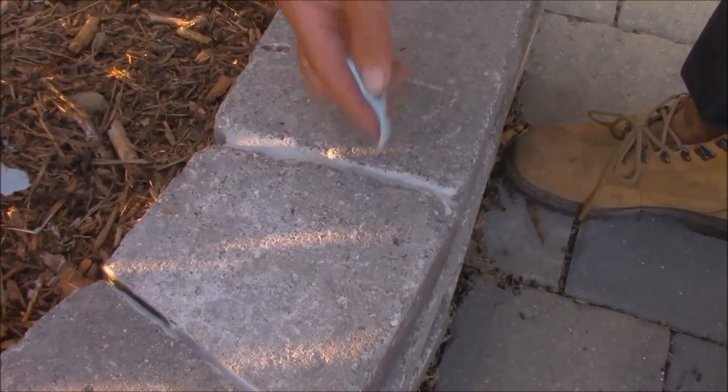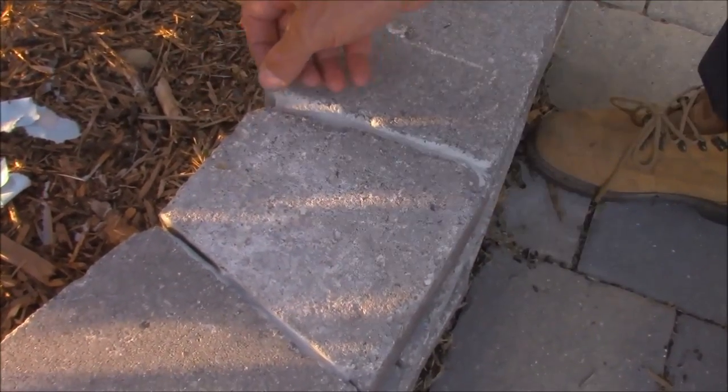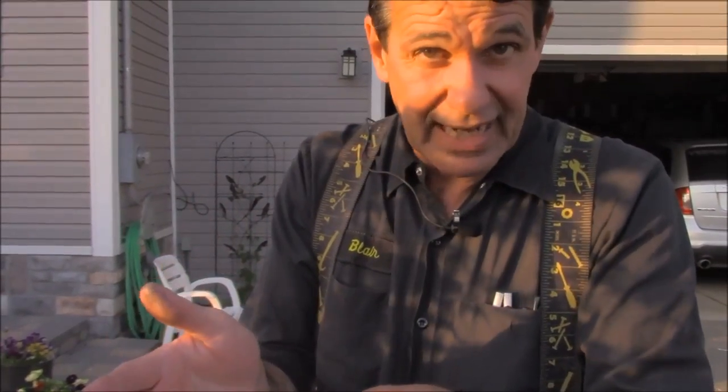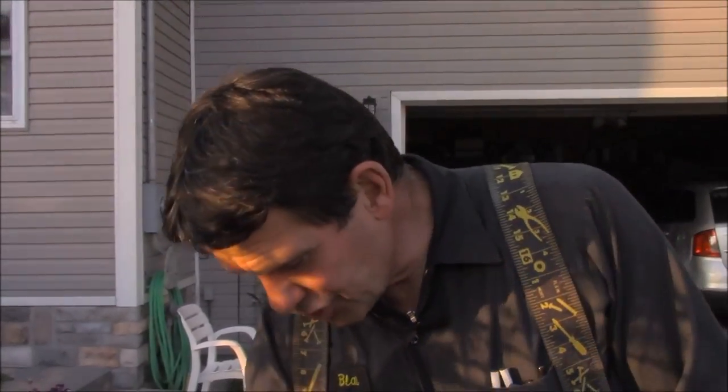I force the caulk deeper into the crack, because where we want caulking is down in between the surfaces that are going to move. Putting a big fat bead of caulk on top only allows mildew and dirt. When you have too much caulk on the surface — when people put a big cove of caulk in there — they think that cove is going to hold the joint together. It's not. Where it's going to hold the joint together is in between the two moving surfaces. You want to get the caulk down in the crack to actually bind the two surfaces together, whether in your shower, kitchen sink, or out here on your bricks. Our goal is to fill the void and keep it clean — keep the caulk joint discreet.